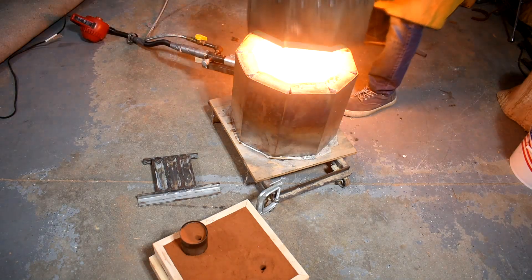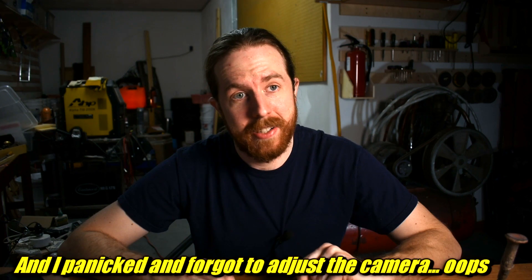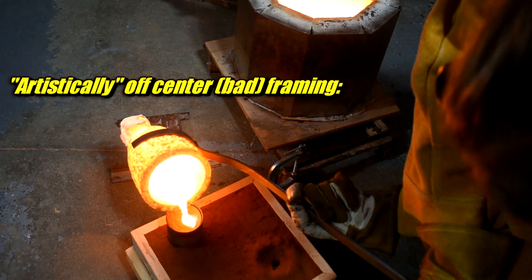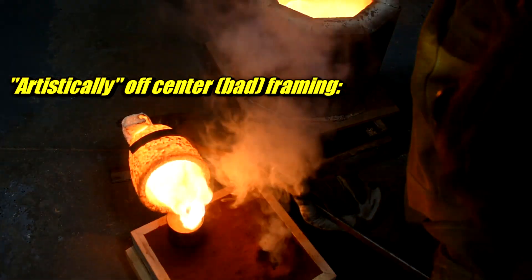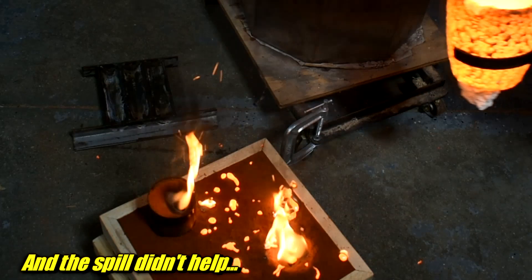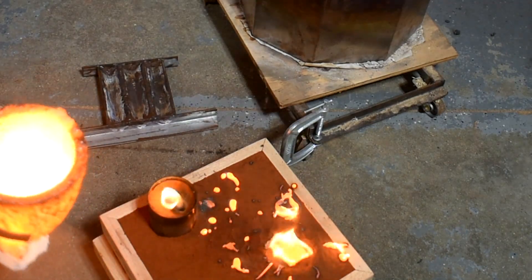I haven't actually used this burner in a long time and I kind of forgot how much of a pain it was and how ridiculously overpowered it was. I definitely poured this bronze much too hot and some crazy stuff happened because of that. I can only guess what was happening inside the enclosed flask, but it seems like the crazy overheated copper caused the wax in there to boil and a whole bunch more off-gassing out of the wood. Because this was closed up and I didn't add extra vents, that just bubbled right out of the feeder all over the place, and then the bubbles suddenly stopped — probably when the bronze froze, trapping the air inside. I wasn't confident there was enough bronze in there.